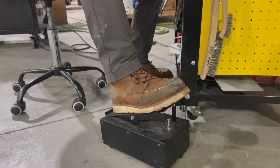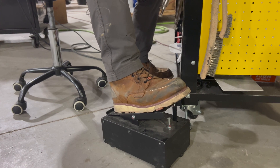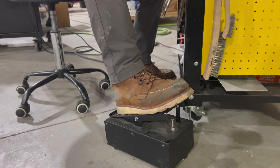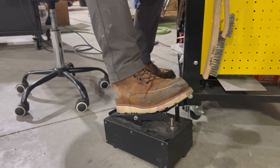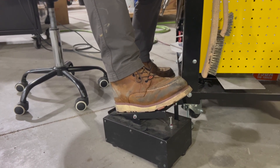Essentially you're going to see me ease in really gently, get my arc started, give it a little more juice to build it up. And then as I get going you're going to see it stay the same, and then I'm going to adjust based on heat. I'm going to try to run across this piece of aluminum about halfway, nice and uniform. Here we go.